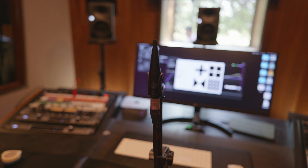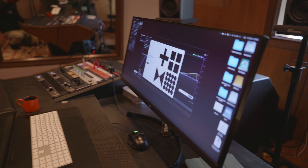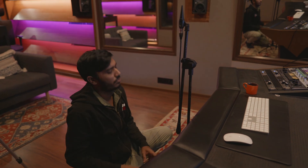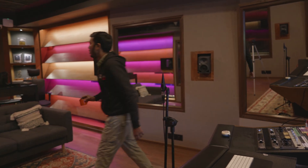If you've never calibrated your room before, it's an interesting experience. Essentially you're taking impulses of the space and seeing how much decay there is over certain frequencies. You'll hear your monitors do a full sweep from 20Hz to 20kHz, reacting to the RT-60s — how long it takes for a particular frequency to die out. This depends on room size, room modes, comb filtering, and other complicated acoustical science. We rely on software calibrations like Sonarworks to help us get a more natural, neutral experience when mixing.